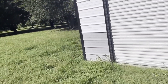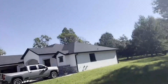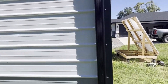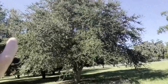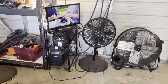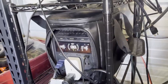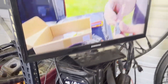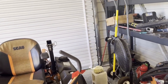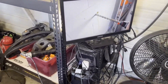Over here we have the smaller ground-mount style with just one additional panel. This is really good because when the sun goes this way and casts shade from the building on those panels, I can either tilt these out, or if I'm not using it a lot, this one will catch enough to keep it powered up and continue catching sun all the way down into the sunset hours. The reason I chose the Delta 3 Plus is that even though it only has 1,024 watt-hours of battery, it has two solar inputs rated for 500 watts each, which you can overpanel. I have 700 watts on the first channel — that's fine, it'll only pull what it can pull — and I can use that second channel to bring in some additional sunset sun.